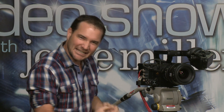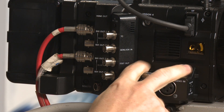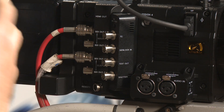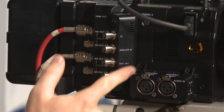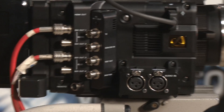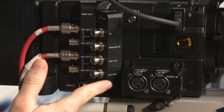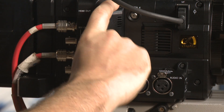Let's talk about a couple more physical features. Sometimes you want to take this camera apart and make it really small. You've got your standard dual XLR input here, but you see these two screws? That means you can take this audio block right off — if you want to get real small and skinny, or fit it in an underwater housing. Another block that comes off is this one: timecode. You can set a switch whether your timecode is coming in or going out. There's also genlock if you're going to match a couple of cameras up, and shutter sync for 3D work — syncing the shutter on two cameras right down to the shutter closing. And finally, a test output giving you composite video. This entire block, just like the audio block, is removable.